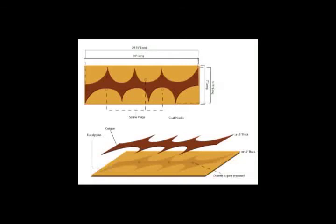And then I have some dowels where I will be putting the screws to mount it to the wall, and then put a plug on top of it, a dowel that'll plug in and then won't be glued, so that I can pop it back out with a screwdriver in the future and take it down if I need to. The more detail you put into it, the better off it is, and the more likely you're going to have everything you need.